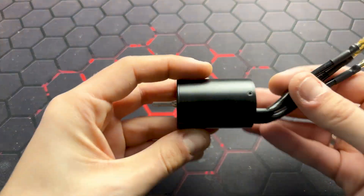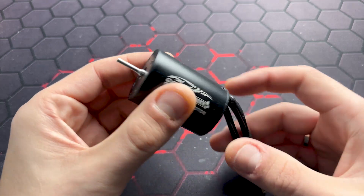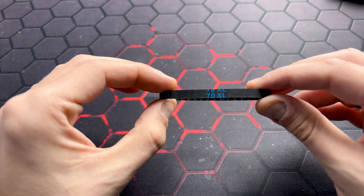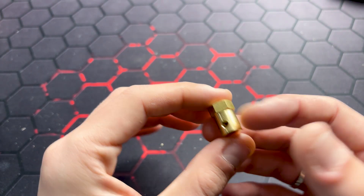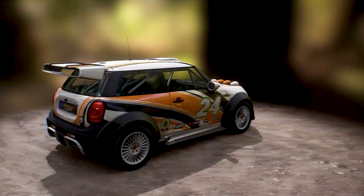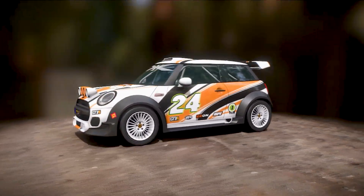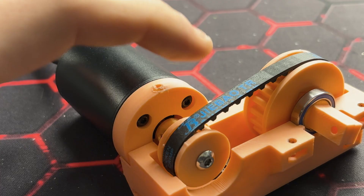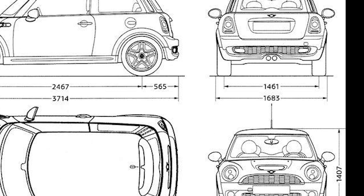Let's start with constraints. I am going to use a brushless motor with a 3.17mm shaft and an XL70 belt. I also don't believe that a printed capstan could survive with my motor, that's why I also bought a brass one. And lastly, since I am about to build a specific 1/10-scale car, I am limited in space. That means the reducer should be as compact as possible, because the chassis overall width is limited to 13 cm.